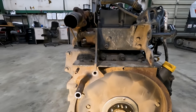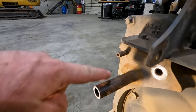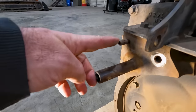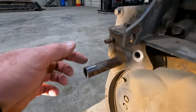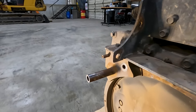Not a whole lot to see on this side of the engine. This pin and roll pin here are for the tensioner, and the new engine did not come with that, so we had to install a new pin and roll pin. I didn't try to extract the old ones — you usually damage them trying to extract them, so it's always good to replace them. This is only on the D34 engine; on the D24 we don't have to do that.